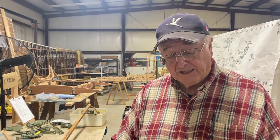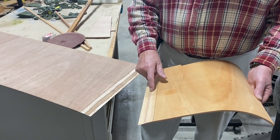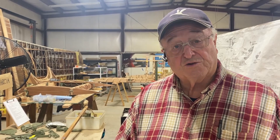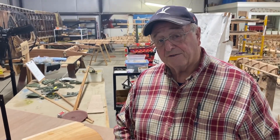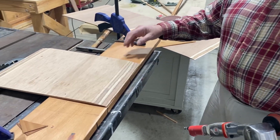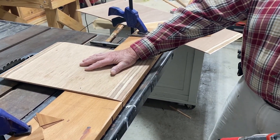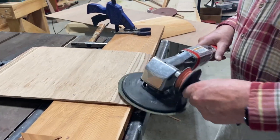We supply two pieces of plywood in our kit for the construction of the wing walk. They will need to be scarfed and joined together on the wing walk structure. A little practice might be in order to get this scarf — it's a little tricky but very doable. What I do is I put a plank down on a hard surface, attach it, take a practice piece of plywood, and tie it down with little nails. Then I'll pass the air grinder across it.